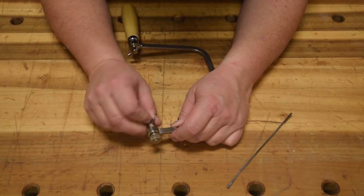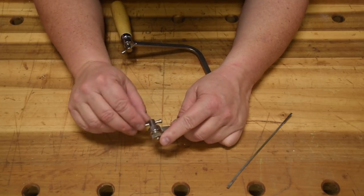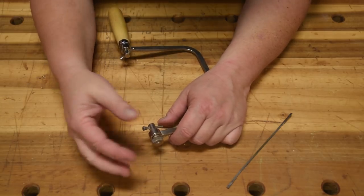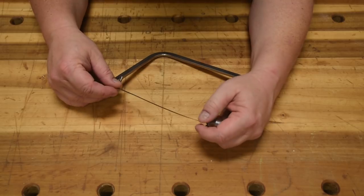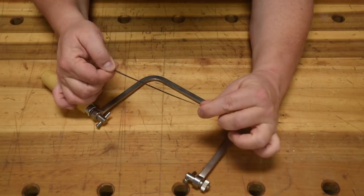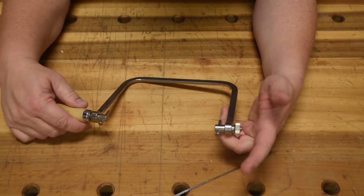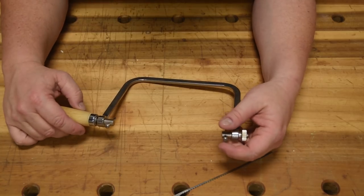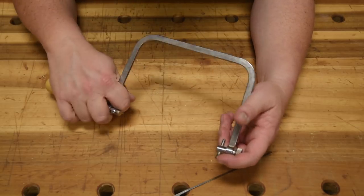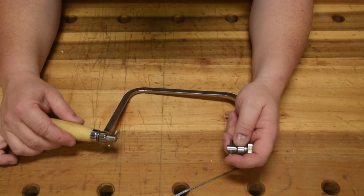The other problem is this little doodad right there — see how it spins so easily? If that's what's holding your blade and it spins super easy, it's not going to hold the blade in place. When I was first working with coping saws, I found I was constantly twisting the blade in the unit because the handle would twist one way and that one would stay locked, or it would twist within the board because I was torquing it instead of moving and turning at the same time. User error — but for whatever reason, they were always coming out undone.